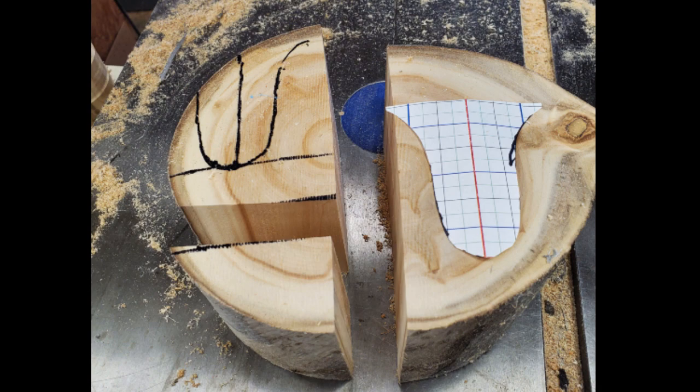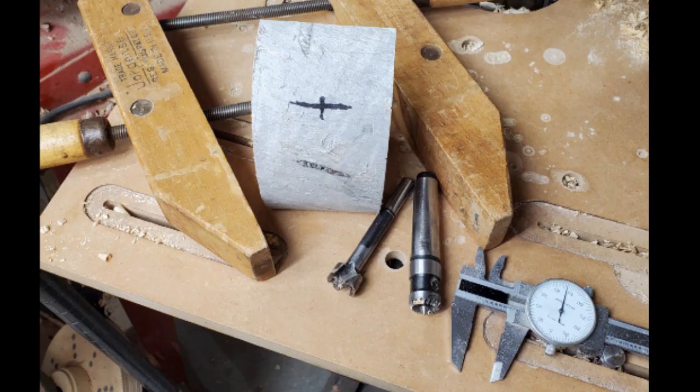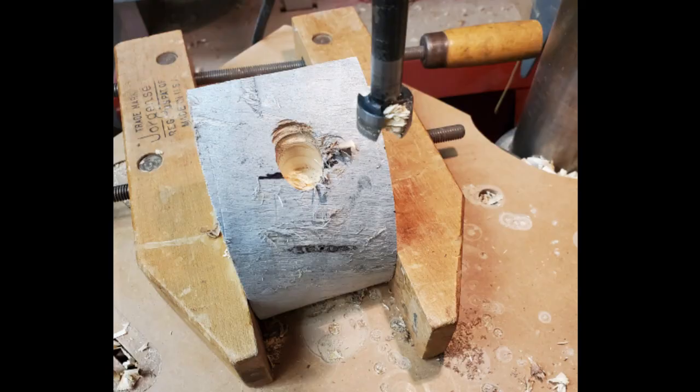Brain cramp over — now it is a simple matter to make another cut. At the drill press, I've marked the turning axis from the flower diagram at half of the width. Now I drill through the slanted side to expose solid wood perpendicular to the turning axis. From previous failures, this hole should only be deep enough to expose solid wood and really no further. Additionally, the hole needs to be large enough for some slack around the drive center — going too deep or too big would cause problems later. The challenge is to start a hole on the slope. Success! The little nibbles at the top of the hole will not be a problem. By the way, these clamps are not the current vogue but are very useful for this situation.